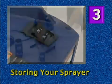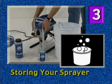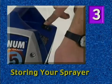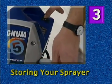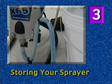With the power switch off, turn the spray prime valve to prime and turn the pressure control knob to the cleaning icon. Turn the power switch on and the unit will begin to pump. Storage fluid will then be drawn into the system and will soon come out of the prime tube.